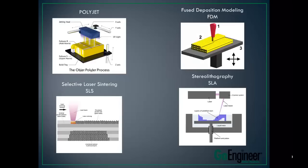There are really four major types of 3D printing — back in the day they used to call it rapid prototyping — but now it's 3D printing. The first one is the PolyJet machine. This works just like your paper printer: the head goes back and forth and lays down a polymer that is UV-cured. We're going to cover that one a little bit later.